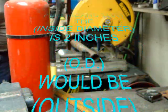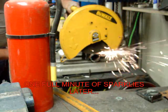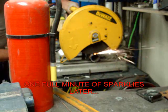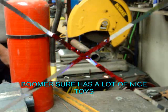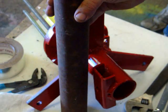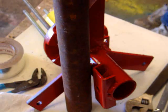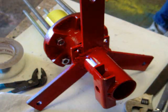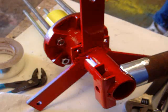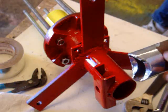We've got some two-inch ID pipe here with about quarter-inch walls, clamped in and set up for a square cut. The pipe has to be on this side, but you can't just weld at one little spot — that's not strong. Plus, it has to be tilted forward so the turbine leans back, because the wind comes down about four or five degrees rather than straight across. So you cut a shape into the pipe so it fits, giving you a solid weld. I'm going to make a bracket out of this piece of pipe — tracing the same shape but rotated back a few degrees.